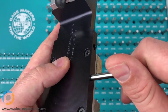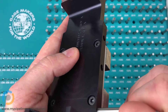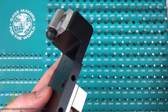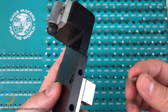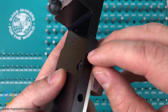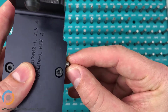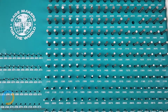On the middle hole it actually goes in a little bit easier. You can hear that pop when pulling it out, indicating an almost airtight seal with almost zero gap. So we have a two zero four five pin fitting in a hole that's supposed to be less than point two zero three six — which tells us this certainly will not be a press fit. It is machined out of spec. Sure enough, if we try to put the plug in, it just slides in and shakes out. That's not good.